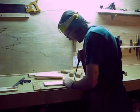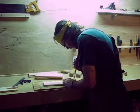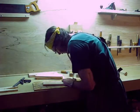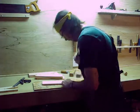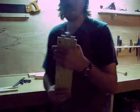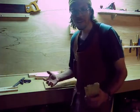I'm not sure if this is larch or hemlock — it's some kind of white wood. Be careful about making drawers out of pine. Pine does not dovetail well; it likes to sort of squish instead of cutting. We like cutting, not squishing. You're going to do all of them but clean them up mostly. Remember, you're going to be gluing and puttying them, so don't try to be perfect at this point.